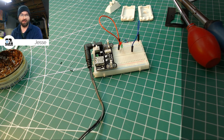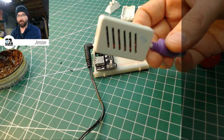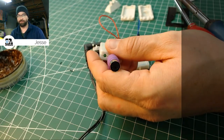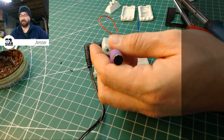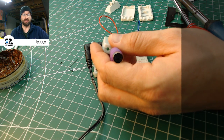So basically, there's a microchip in there that's a Pro Micro. It costs about $3, and if you put this together in this fashion with the Soarer's converter software installed on it, what you end up with is a controller that you can plug an old PS2 keyboard into and come away with a fully programmable keyboard with full n-key rollover and the ability to program macros anywhere, just like on a modern QMK setup, but with a vintage board and without disturbing the stock internals, which is really kind of cool, especially if you want to keep your nice heavy original IBM cables.